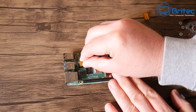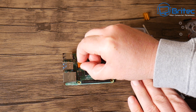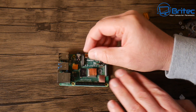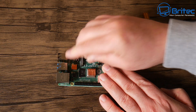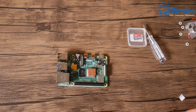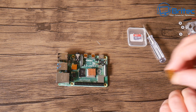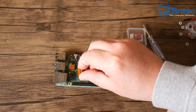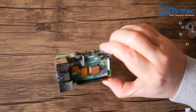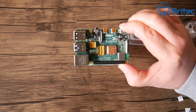That little GPU is in the corner there - just need to put the heat sink over it. You can put them on in a different sequence, but they're all sized for their particular chip, so whichever one you pick will fit exactly on that chip. This one is the GPU, and we've just got the memory to do. We put these on to cool down the Raspberry Pi as much as possible. There are better kits out there with twin fans that cool it down a lot better, but this is a great starting point.